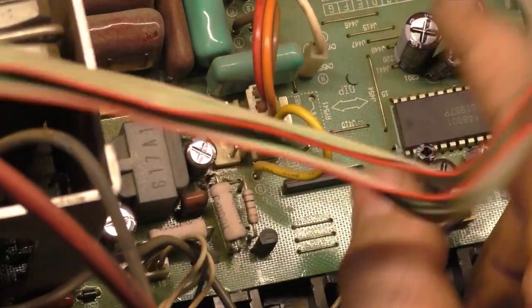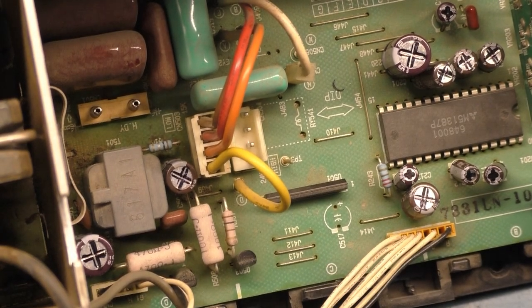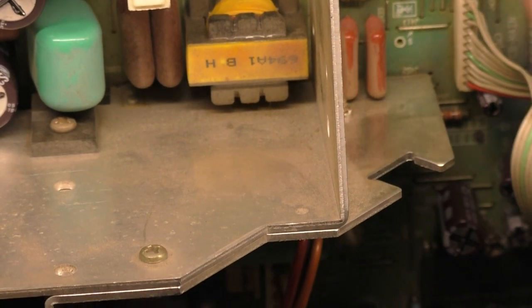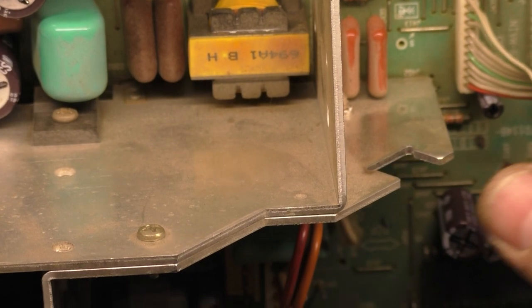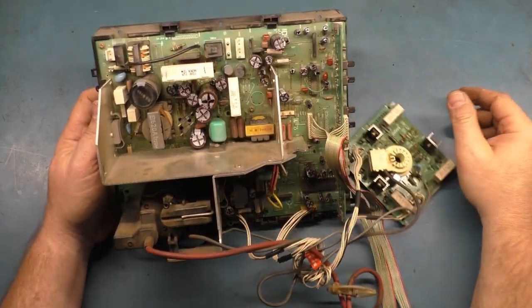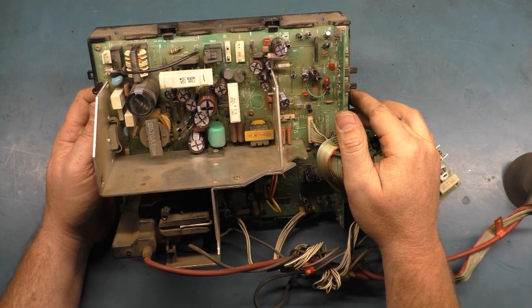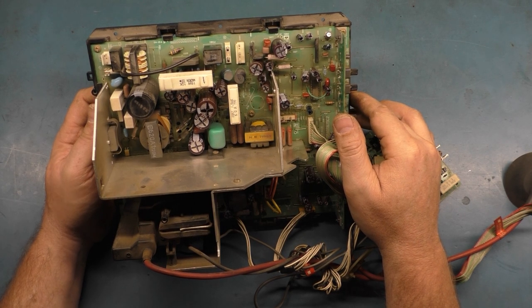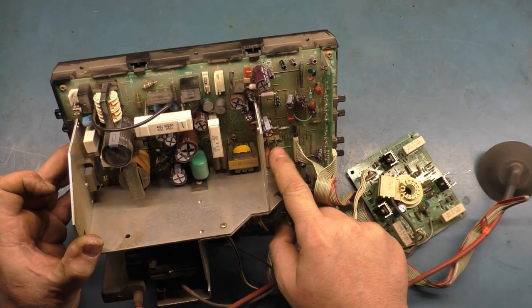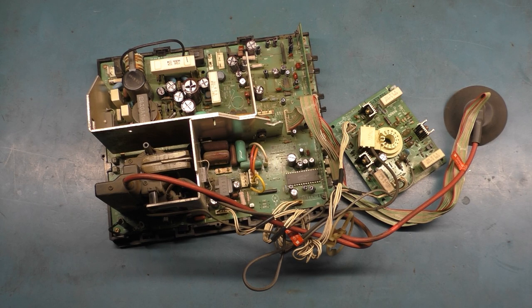And then we have our connection here, still on 25. So 25 medium res, you can flip it over to 15 kilohertz standard res, and it's a dual res chassis. So the yoke is specific for this chassis. You can't just throw this on any other yoke, like the 7500 and so on. So that's about it to go over. Everything should work, hopefully. I mean, pretty confident. There's a couple oddball caps in here, like 180 microfarad and a couple of 680 microfarad, not common ones, but I was able to make it work. We also got the header pins for the vertical all cleaned up, like I showed a few moments ago. So nothing left now but to get it back on the tube, turn it on, and see if it looks any better.